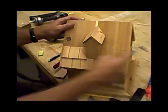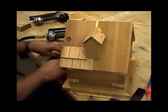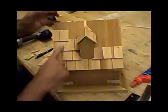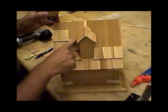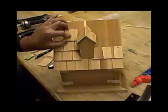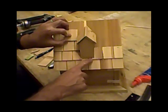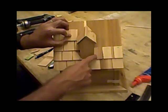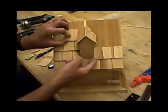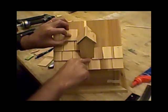You've got to do the exact same thing working on the other side — bring your next level up, draw the next line, and build all your shingles across the top. Now you can see that I've brought the shingles clean up to where we now have to worry about going around the roof of the dormer. It's not a terribly difficult thing. One of the things you need to be ready for is that you will break some little pieces of shingle. When I was cutting this one over here, I broke this little nub off two or three different times before I finally got one. That's just the way it is.